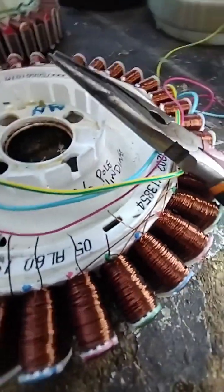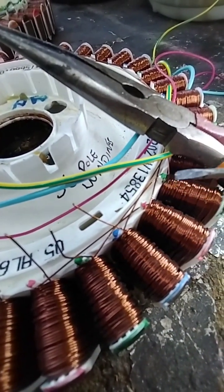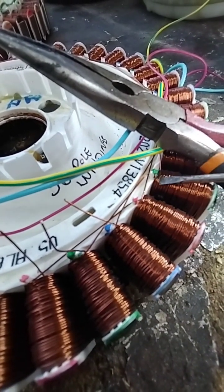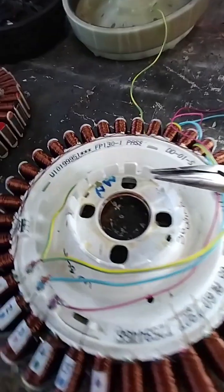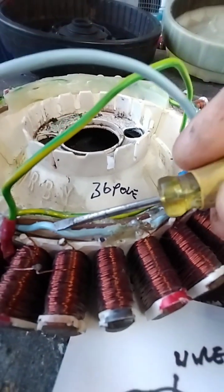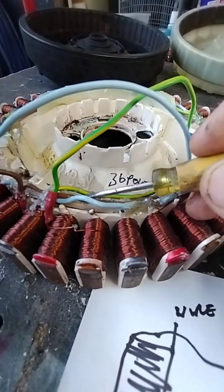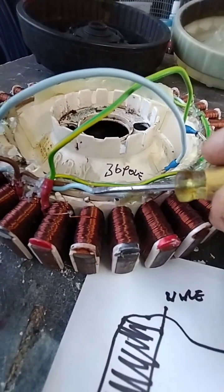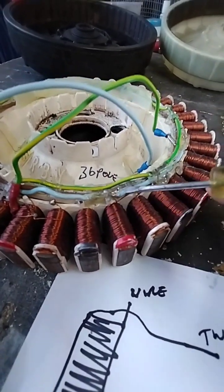You just keep going around, and once you've cut them halfway between those two points — remember, it's halfway between the left-hand side of this coil and the left-hand side of the next coil — you have to cut every one of those in half. Once you cut them in half, you'll find you've got enough room to run them to the wire. Make the wires really close to the edge, because this big magnetic thing is spinning on the other side. What you'll end up with is all the right-hand sides of the coils joined into the corresponding wire, and all the left-hand sides twisted together.